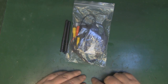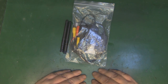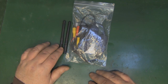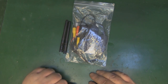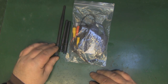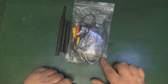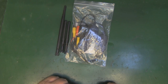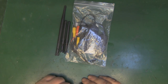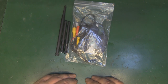At the moment they look like they've got a little monopole antenna, so we're going to put some kind of SMA adapter on here, remove that monopole, and that way we can stick one of these little dipole antennas on - or maybe a slightly longer one. This is 2.5 dB and this is 5 dB, whereas a monopole like this normally runs at about 2 dB, so it's a little bit of an upgrade and gives a few more options with this little transmitter.